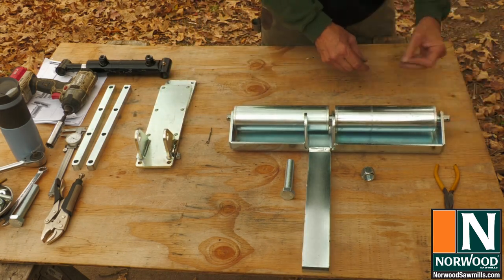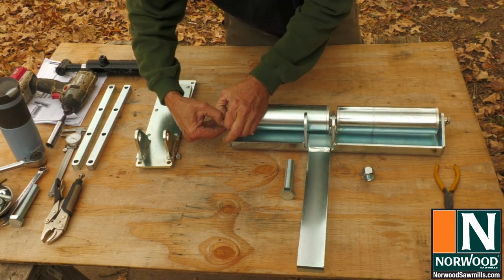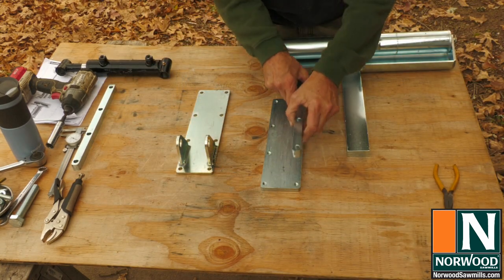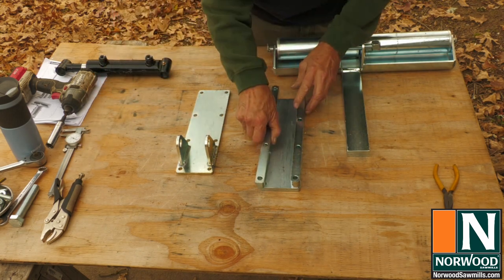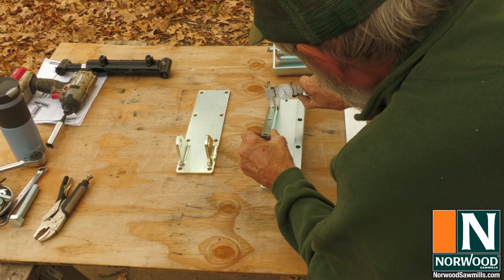Start out the tow roller assembly by running the axle through the bracket and the rollers, and put a cotter pin on both ends to hold the axle in place. I've noticed that the holes in the spacer bars are just a little off center, and they will bind up that slider unless you put the edge with the holes closer to it toward the inside. If you look carefully, you can see the difference, but I put a mic on it just to be sure.